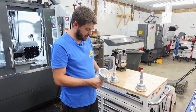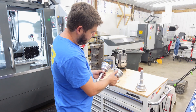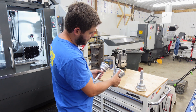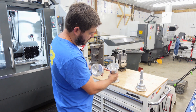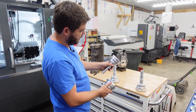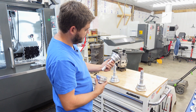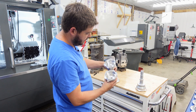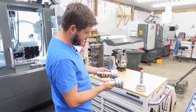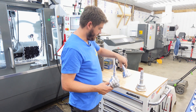The other thing that's kind of obvious when you look at it is everything has this big dovetail chamfer on the back. On the old one, there was one spot right here where it says Z1 top — that was the only spot we did that. Now we decided to do it on the whole thing and it looks pretty sweet. Having that all the way across just kind of elevates the shape of the part. Everything on the top engraving is all the same still. Everything on the shape is exactly the same — ID is the same, all that stuff.